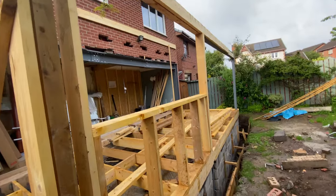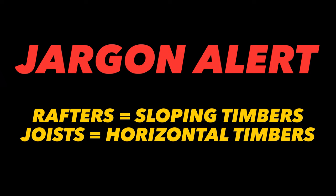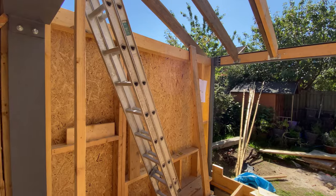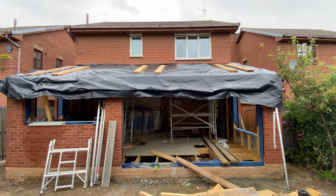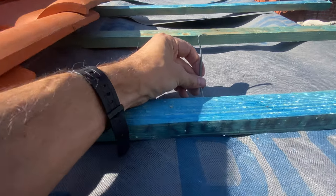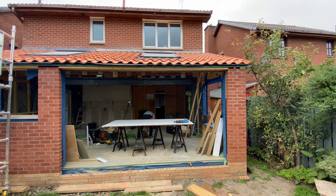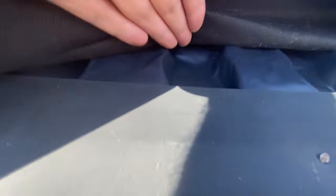With the wall plates at the eaves — and you can see we've put the ridge one in place against the existing brickwork — we can cut and set in the rafters. We'll use the metal hangers that the structural engineer has specified to keep the rafters in place. I'm using a traditional detail for the roof as I've chosen a natural clay pan tile, which can work at a shallow pitch as I'm constrained by the height of the eaves and the position of the existing first floor windows. These tiles are fairly easy to install as they come with a mechanical fixing system and accessories to make it easier for someone without a huge amount of roofing experience. Any water blown through the tiles will be caught by the membrane and taken down to the gutter. We'll follow the manufacturer's instructions for all fixings, eaves and ridge vents to maintain any guarantees.